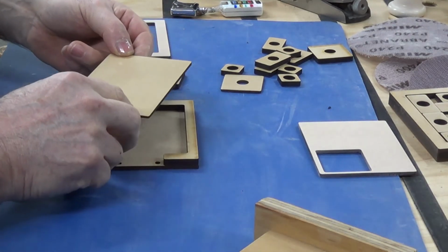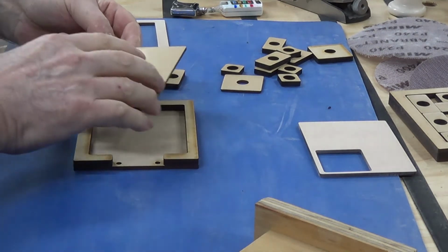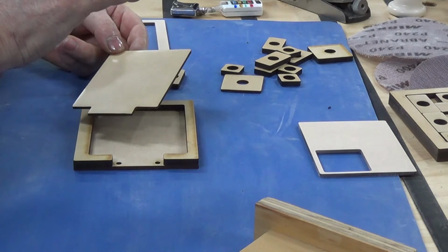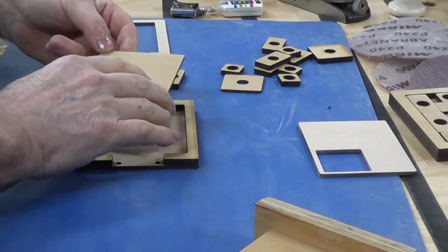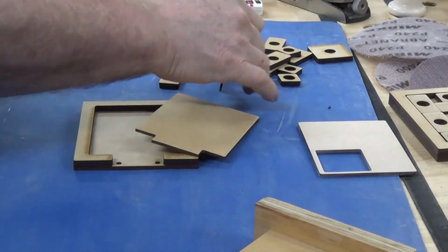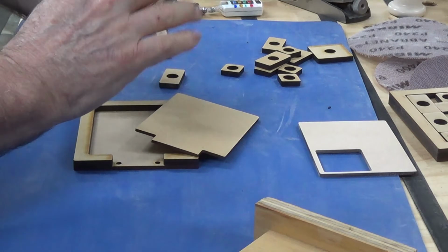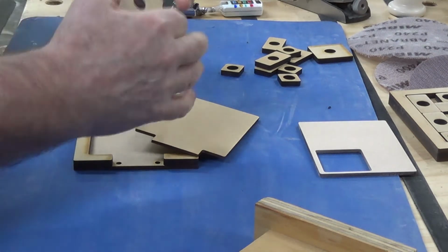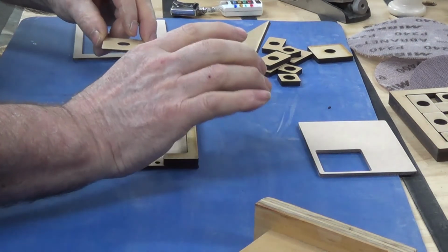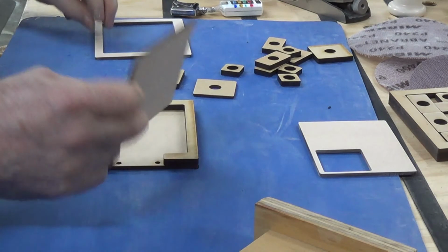I use the Beall system, which consists of first pass with Tripoli wax, then white diamond, finished off with carnauba. And forgetting about the mops they use and all that, or the buffing wheels, that system itself just brings a beautiful shine and finish to MDF.